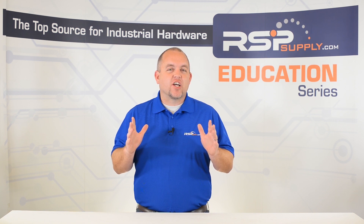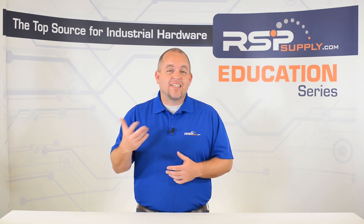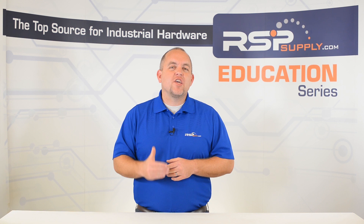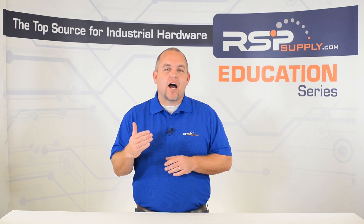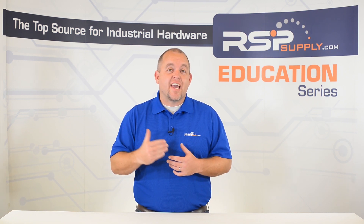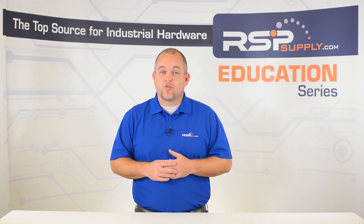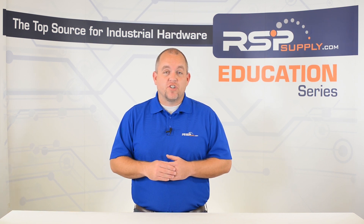Let's take a closer look at these two different ways you can perform an e-stop function and learn more about how they work and why these standards are used. Before we get too far, let's briefly talk about why you might want to have an e-stop circuit in the first place. An e-stop is used when you need to have the ability to cut power to potentially dangerous hardware. The e-stop provides a very simple, safe, and fast way to cut power and stops the function of hardware such as motors, cutters, conveyors, and other common industrial equipment. This stop function should occur without causing any additional unsafe conditions. These e-stop circuits are typically used with safety rated hardware such as safety relays.